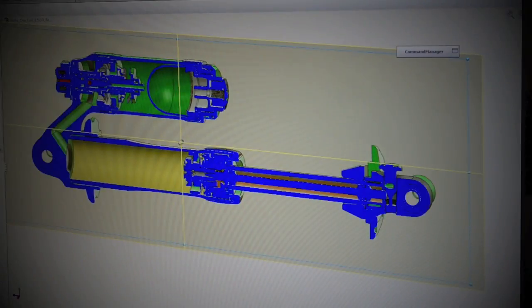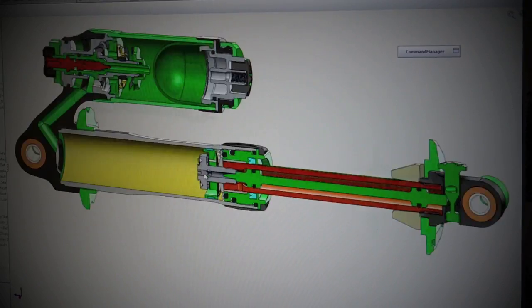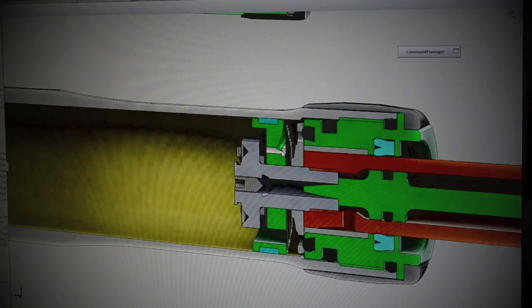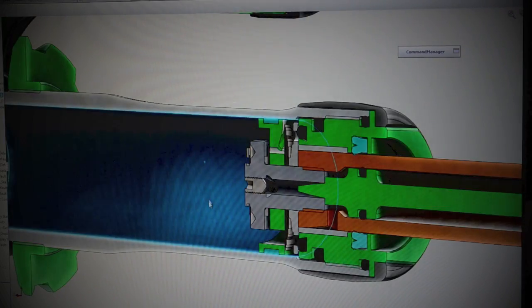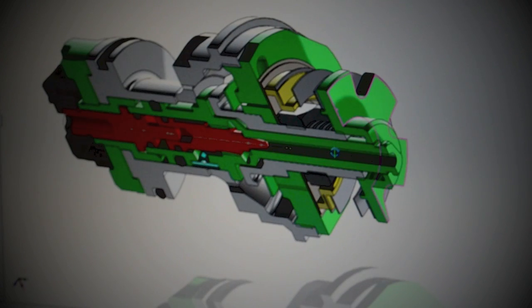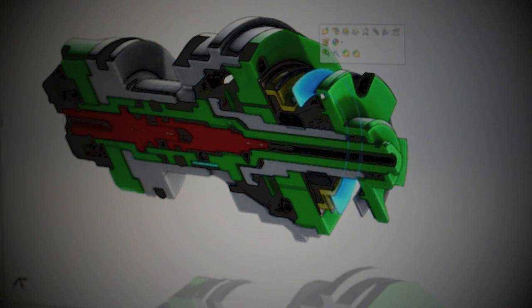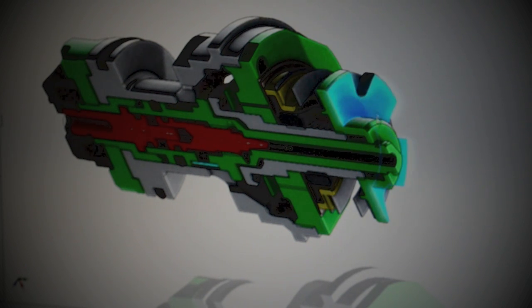It's a really cool unit. Let's show you a cutaway of it. As you can see the inner workings — high flow piston. It's actually a 25 millimeter internal body. This is the actual loader itself. It's meant to be really quick and easy to tune via the shim stacks, and there's a spring that's being loaded by this plate here which actually changes the effectiveness of the shims.